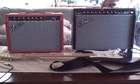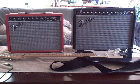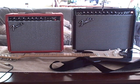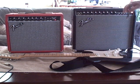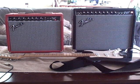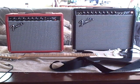And then if you flip the switch, which is the white switch right here, then you flip over to this channel, and all these controls are now disengaged, and it's completely the equalization and stuff on this side. So again, the drive, control, and volume, how dirty do you want it, how loud do you want it, treble, middle, bass, and reverb. Reverb is engaged on both channels regardless of which channel you have selected. And then they also have a little mid-contour defeat switch here that if you press this in, it scoops out the mids.